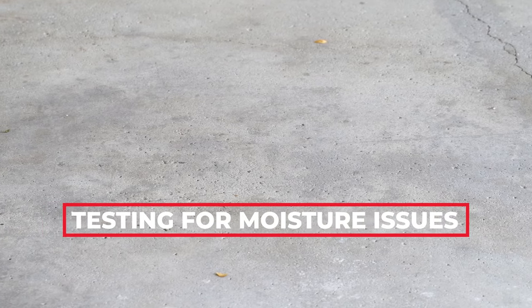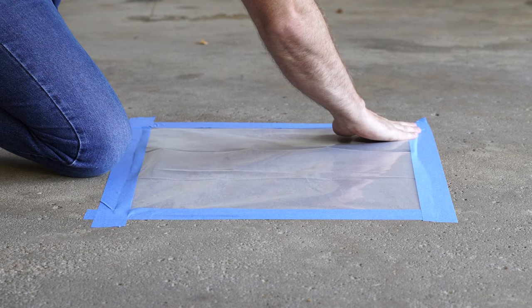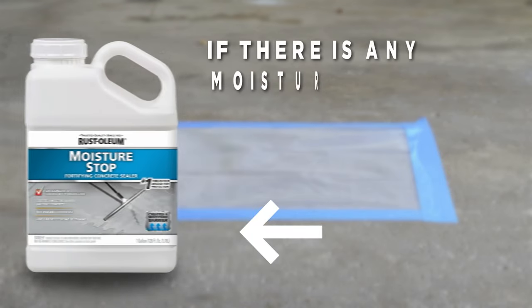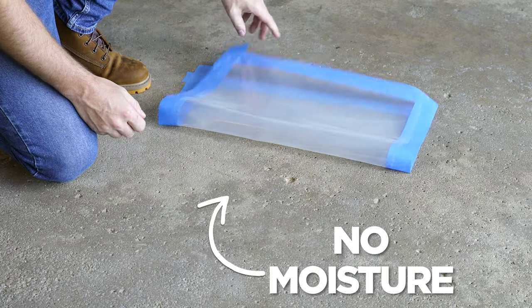The second thing is to check for moisture issues with your concrete. Moisture can influence the effectiveness and success of the coating. To do this, securely tape a vapor barrier or plastic sheeting to the floor and leave it for 24 hours. If there is any moisture or condensation seen underneath the barrier after the wait time, use Rust-Oleum Moisture Stop before completing your garage floor.